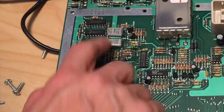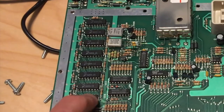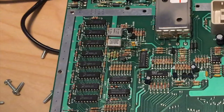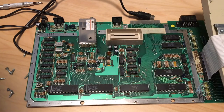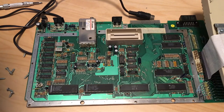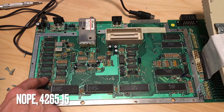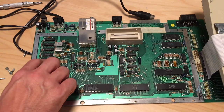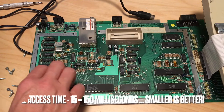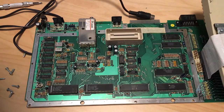Here's the board, and these are the memory chips in question. They are numbered from U9 to U16, U15, U14, U13 — a little weird numbering. These are the custom Atari chips over here. My first attempt would be to get some replacements for these 4264-15 chips, and there's also a 4264-12 — I guess the last two digits indicate timing. So these are all 4264 chips and I'll need to get replacements.